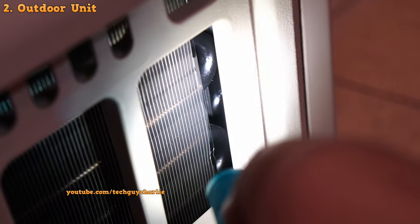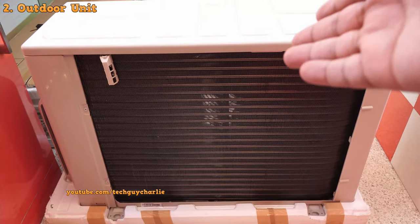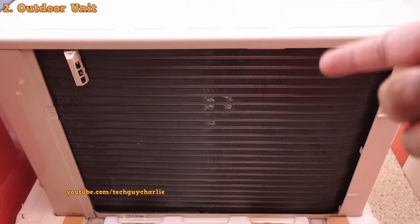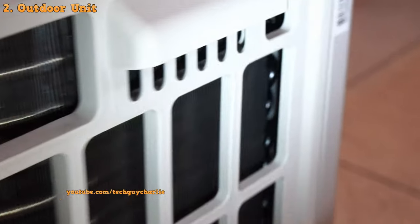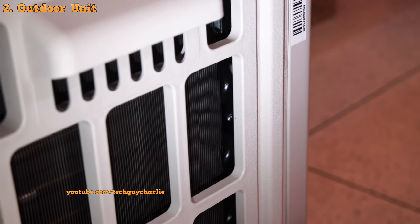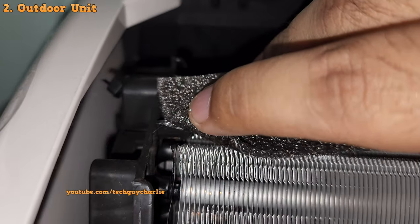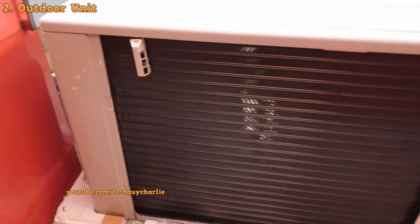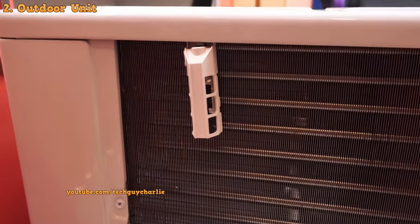If I shine my flashlight on the edge of the condenser coil, you can actually see the second row inside — a lot of surface area, which is awesome. LG claims this is a copper condenser with anti-corrosion coating they're calling ocean black, including on the U-bends of the coil where leaks due to corrosion usually develop. You'll also find this coating on the left side of the indoor unit's coil, and this little thing is the outdoor temperature sensor, which helps the air conditioner calculate how much power it should be running at.